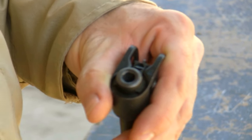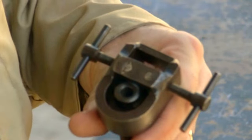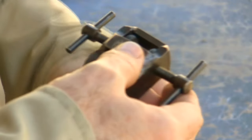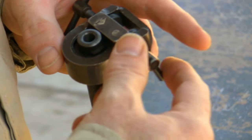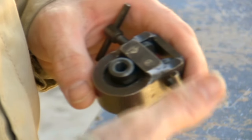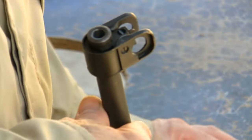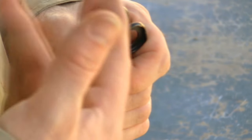These front sight tools are really difficult to find. All you need to do is get yourself an old fashioned worn-out screwdriver, cut the end off, and using your Dremel cutting edge, cut yourself a bit of a groove so you can tighten the tensioner, because some sights are slightly loose inside the dovetail. If you need to adjust for horizontal, you need to get yourself one of these tools — there are various versions, but this is one of the originals with the broad arrow manufacturer stamp. You make increments of 1/32 of an inch, which at 25 yards gives you a 1.5 inch variation of horizontal on target.